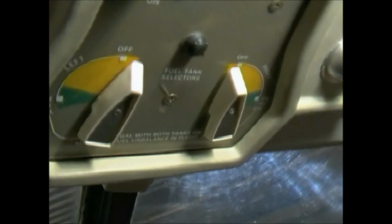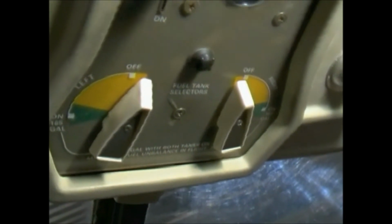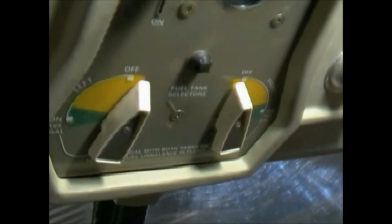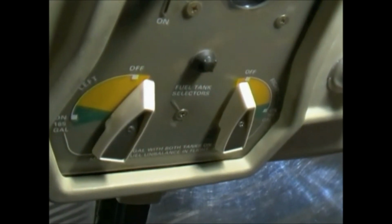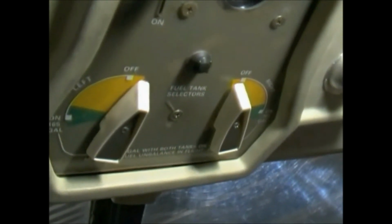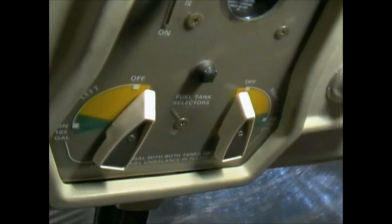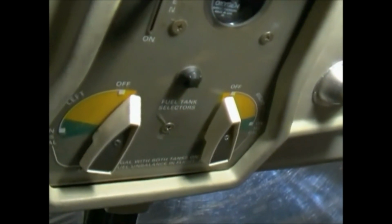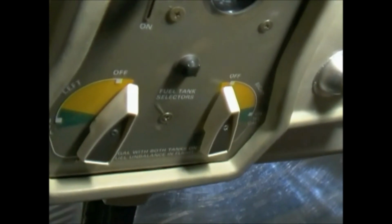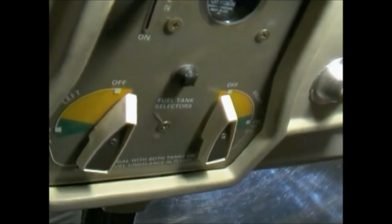On the belly of the airplane there's a reservoir, there's a little hopper tank. It is designed with some flapper valves, designed with gravity, because the gravity makes them hang open, so they really don't do a whole bunch of good. So the pilots can't take off and use their autopilot with more than 150 pounds of fuel imbalance from side to side. And so if it's too much, you're going to have to transfer fuel or add more fuel to the low side.